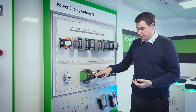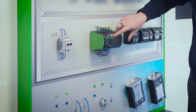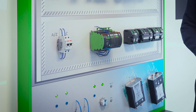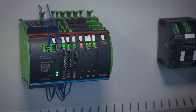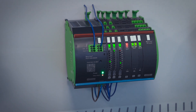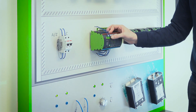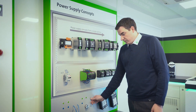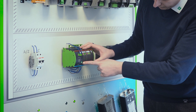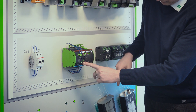It has multiple states. Green is healthy. As we apply more power to one of the loads, we can see it goes to a flashing state because it's at 90% of its set current limit. We have short circuit indicated by a red flashing light, which we can remotely reset or manually reset by hand. It has an orange status for remotely disabled. We also have a modifiable current limit — pressing this button, we can increase the current up to 10 amps, or back down to 1 amp.